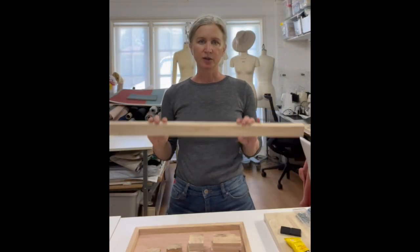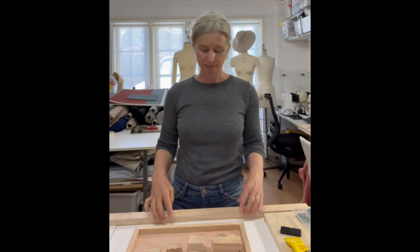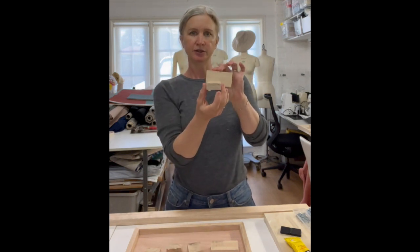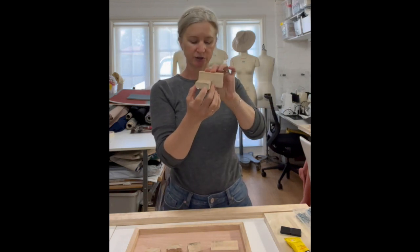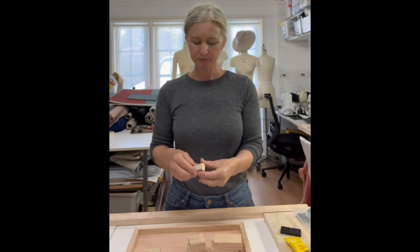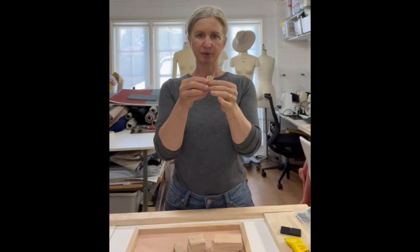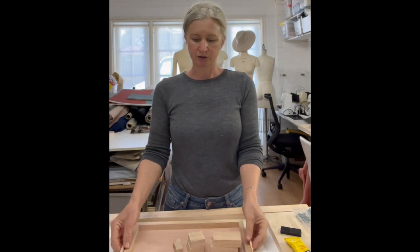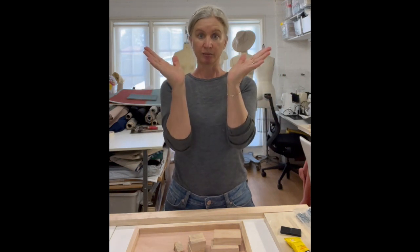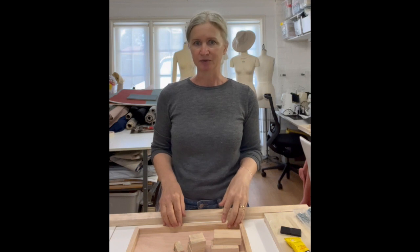Let's chat about the 2x4 lengths. First, cut a pair of 8cm and a pair of 4cm pieces — put together they create the bracket that attaches the pochette box to your tripod. Next, a pair of 1cm lengths — these butt together to create a little platform for our easel. Then a couple of 1.5cm pieces that go onto the sides of the box to prevent them from fully opening. They create a ledge to keep the sides up so things roll down rather than off — very important if you work with expensive pastels.